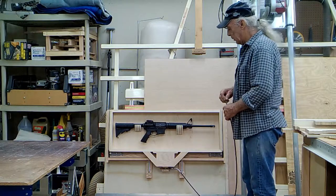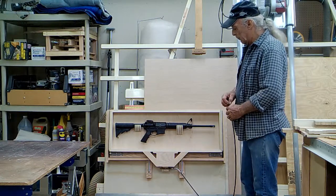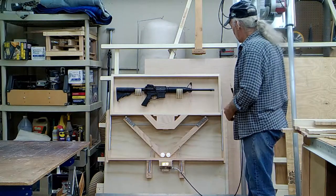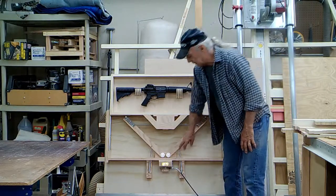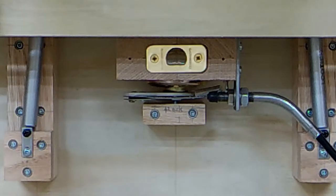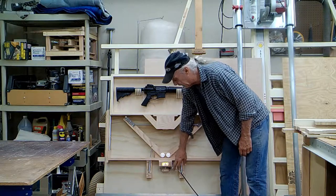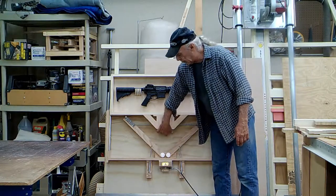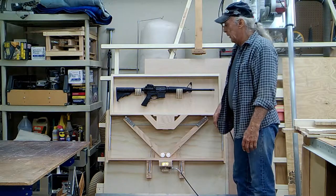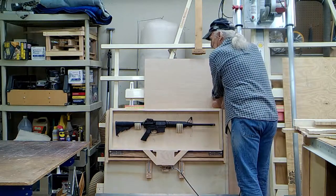The latch itself is activated by a throttle cable, which will be located to a lever somewhere in the cabinet once the cabinet is built. It will rise the tray out of the back of the cabinet. The latching mechanism is similar to my Rising Coffee Table challenge latches — it's just a simple interior door latch that I modified quite a bit, mounted it in its own block, and secured a throttle cable to it to activate it. Underneath this plate is the striker plate that engages the latch and keeps it very securely latched.